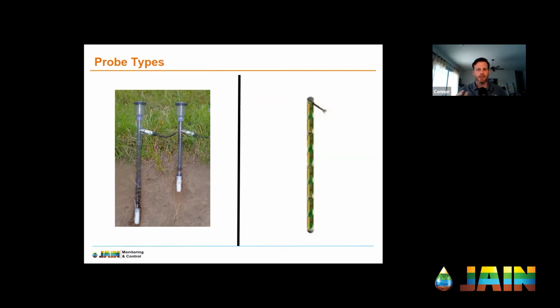In case some of us aren't aware, and I'm sure a lot of us are, the soil temperature is really helpful to have, because if we're thinking about our fertigation and timing our applications and times of year when to inject, some compounds require a certain temperature in order for the chemistry to be effective when we're injecting it into the system. So this is really helpful, so we can make sure to time and plan our injections. Yeah, great point, Connor. Thanks.